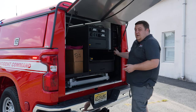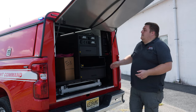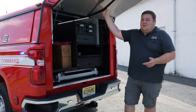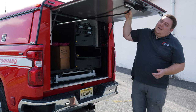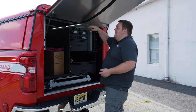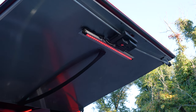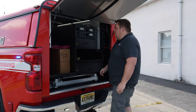We have our electric slide master control with an indicator to show how it works. We have the strap made here — our vertically challenged assist strap. If some people are slightly shorter, they're able to grab the strap at the lowest point and work their way down, making it easier to close the hatch. The Amdor light on the hatch has a bracket to angle it so it shines down. All compartment doors have pin switches which control all lights individually through the control system.